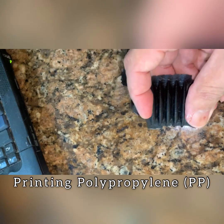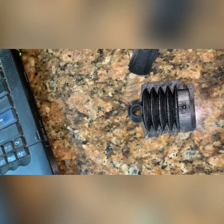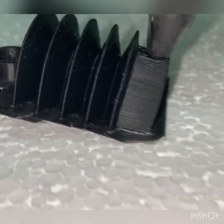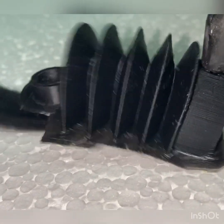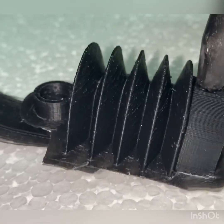The difference is on PLA you need to dilute it one-to-one with acetone so it's a very light coating. And here showing you putting some air in there — you see the way it moves — you can produce this type of action in robotics using all these different live hinges with this plastic.